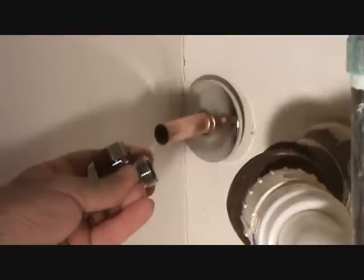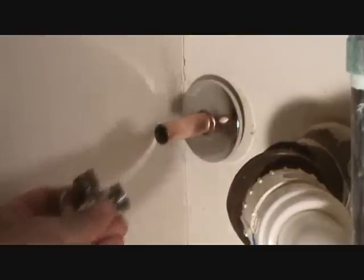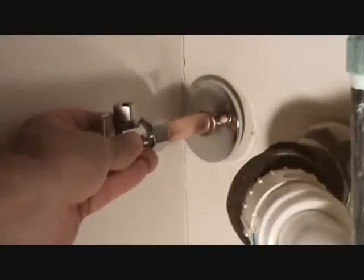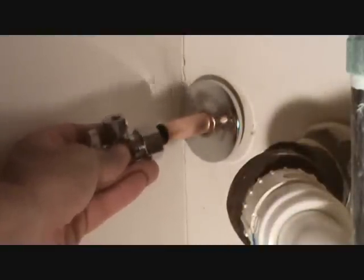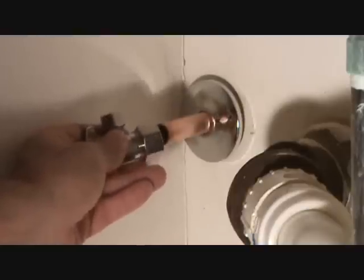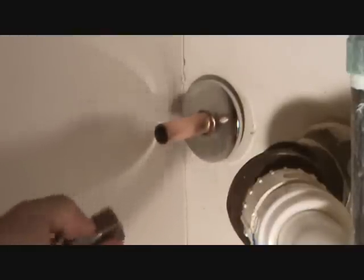Now should I have to do that? No, I shouldn't, but every once in a while you put something on here like this and maybe the first two or three times you do it, you don't have a problem. And then all of a sudden the next time you do it, you've got a leak and you think you'll just tighten it up a little bit. You tighten it up and it's still dripping. Then you've got to pull it apart and put Teflon tape in there instead — so it works.